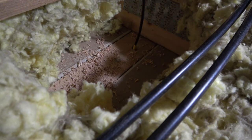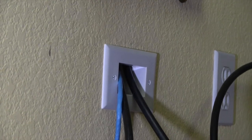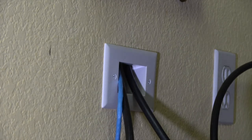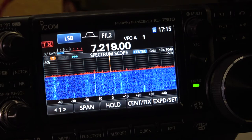Oh, God bless America. We'll put this on an AB switch and then we'll see what the difference is on receive from the ham stick to the vertical diamond. Again, we're just using the ham stick for a receive antenna to balance the noise out, to null it out with the phaser. So let me know what you think. Counterpoise or no counterpoise?